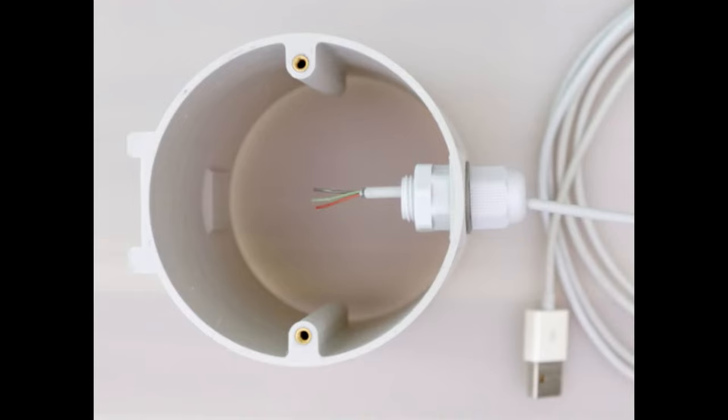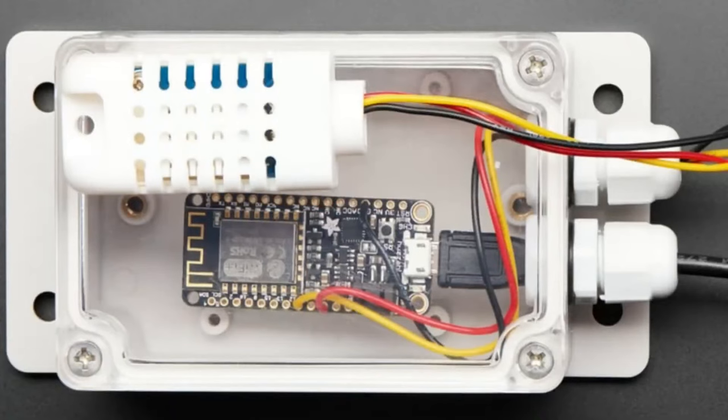These are good for both inputs and outputs. In this case, I'm showing an enclosure that has two cable glands on it. I have one for data, for some sensing. It's actually not the right kind of cable to use, FYI, but I was just doing a quick demo. Maybe if you wrapped it in shrink wrap, that would give it more. It has to be round so that the cable gland actually has something to grip onto. But the USB cable would absolutely just work because it's a round cable. So you do have to use a standard round cable. You can't use a ribbon cable or a flat flex or FFC or something.